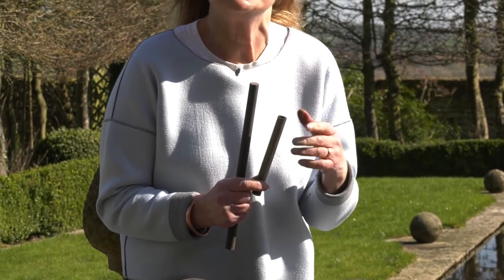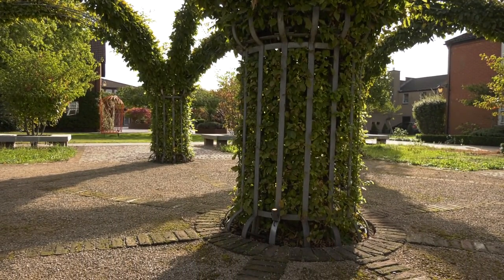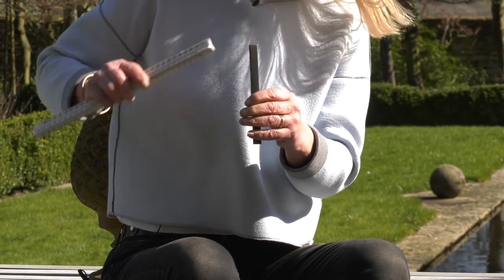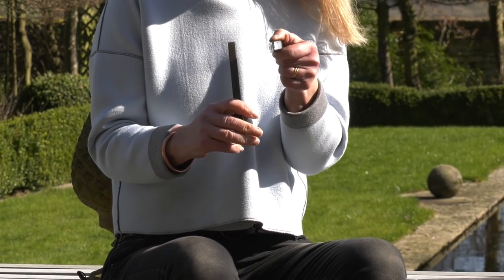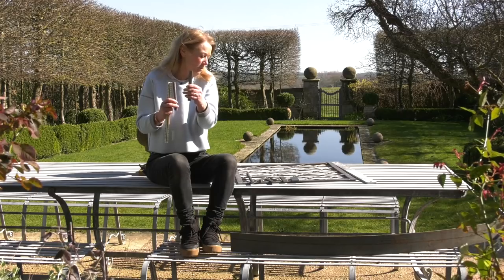If designing something in a public space like the vaulting, I'll get an engineer to check I've used stout enough metal sections, because you'll get people swinging on it and larking around - it must be safe, structurally sound, with decent concrete footings. In a private garden it's slightly less important but you still want it to be safe. There are also square section bars - I've got a small solid square section here, just a centimetre square, compared to a hollow square section which is much lighter but looks more industrial. If you like the industrial luxe look then that might be the one to go for.